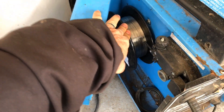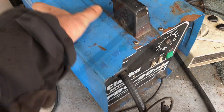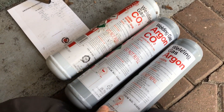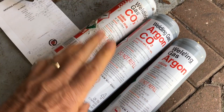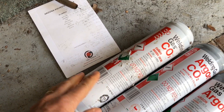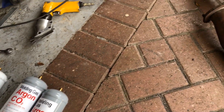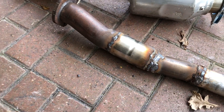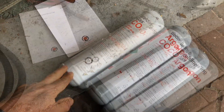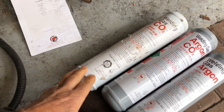If you're welding aluminium, which can be done with a MIG welder, use aluminium wire. For the gas, there are basically three types with these cheap welders: CO2, argon/CO2 mix, and pure argon. Use pure argon for aluminium. For stainless steel use argon/CO2 mix — you can also use CO2 with stainless, which isn't the recommended option but does work well enough for less structurally significant welds like exhaust systems. For steel, use CO2. CO2 bottles in 600-gram sizes seem to last longer than argon bottles.